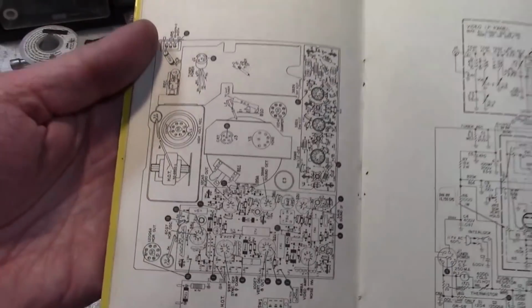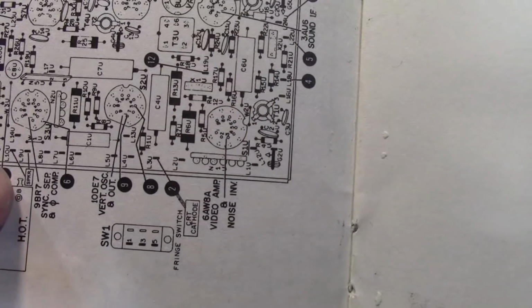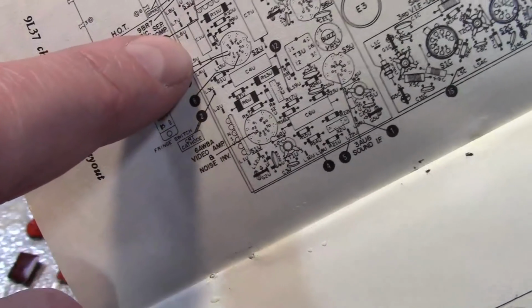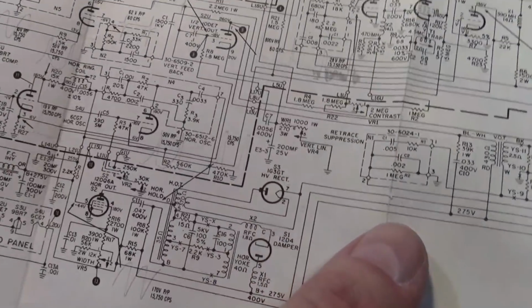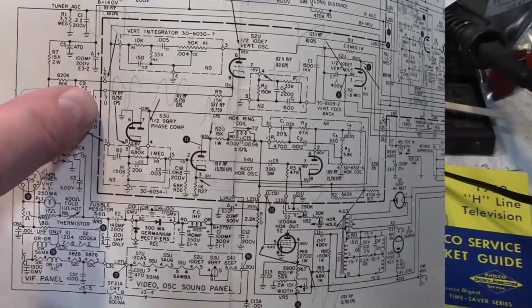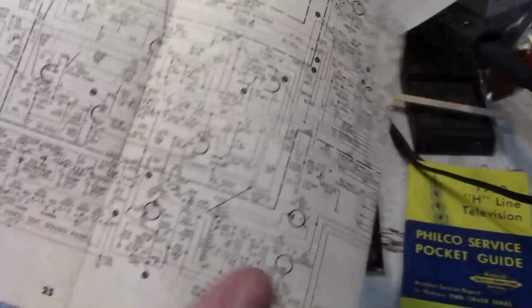So here is the whole chassis. So here is this board we're working on right now. Yes, it's small. Get out your reading glasses, but everything is labeled, including all those stakes where the wire wrap wires go, with labels like L6U, and then you can line that up on the schematic. So all around this dashed perimeter, this board here is represented inside this dashed line in the schematic, and they label all the external connection points. So there's L6U right there. So good aid to have.